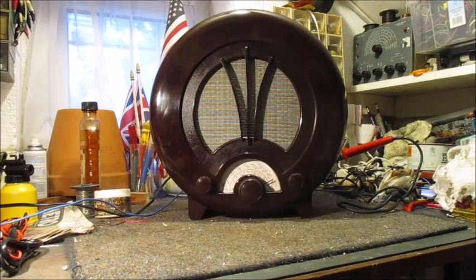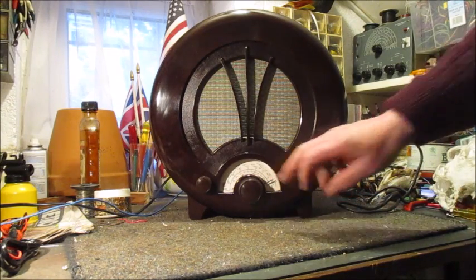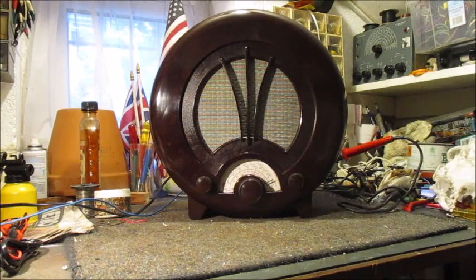There is one task left to be done. That is the alignment procedure. Anybody who knows where BBC Radio 4 is on the long wave band will see that that cursor is miles out. I thoroughly dislike radios that do not have provision for executing an oscillator dial tracking alignment with the dial fixed inside the radio and the chassis that is adjusted outside the cabinet. This radio is a case in point, but I'll slowly work my way through that part of the alignment.